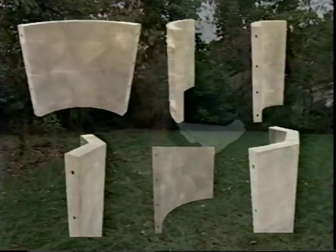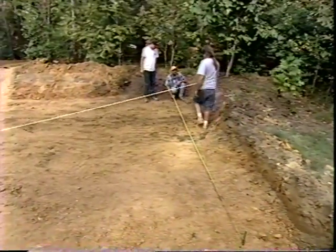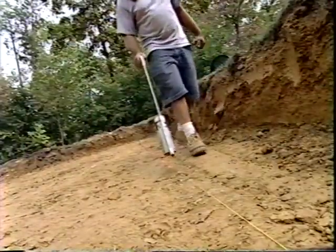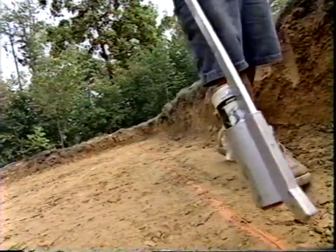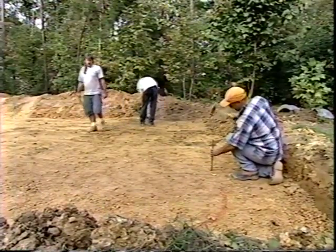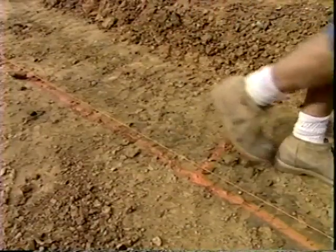With the shallow end and panel shelf level completed, we make more measurements to determine the actual location of the pool. We set new pins in each corner, run string lines, and use marker paint to highlight the pool's perimeter. This also gives us a better look at the panel shelf area. We mark the pool's break point and the deep end before we begin more excavation.